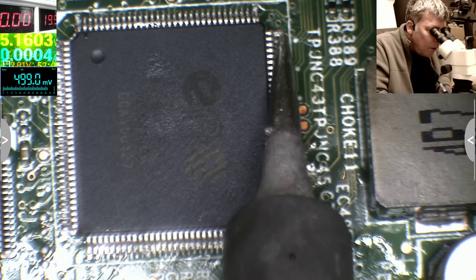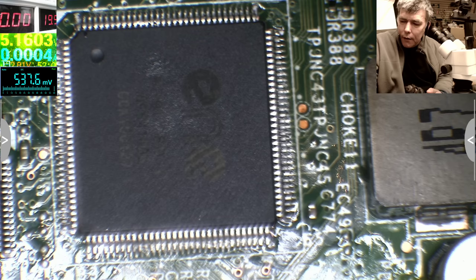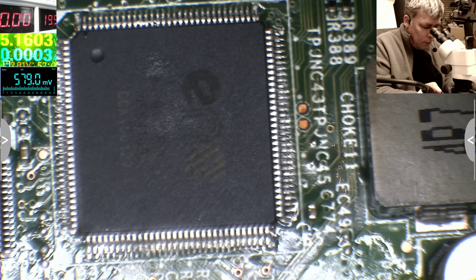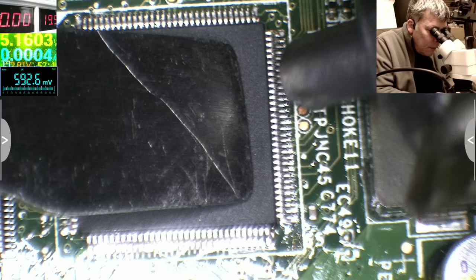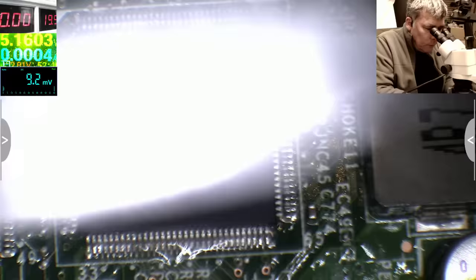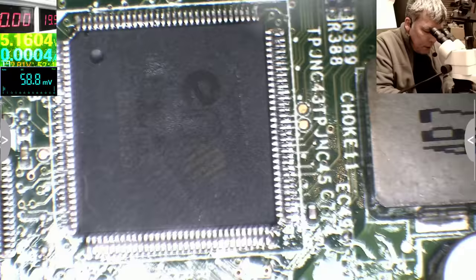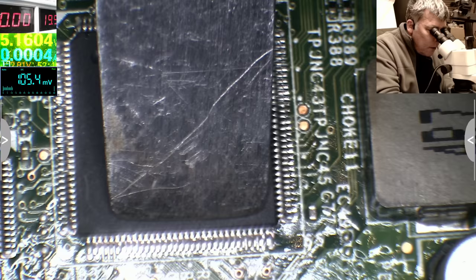So we soldered a few pins. With the small nozzle, 500 degrees. Let's get a tool to press the chip down. Okay, here is fine. It's not fine. We'll come back later. Okay, seems to be fine. Obviously, with 500 degrees, it's kind of risky to play on the new chip. So pay attention, don't heat up the chip too much.